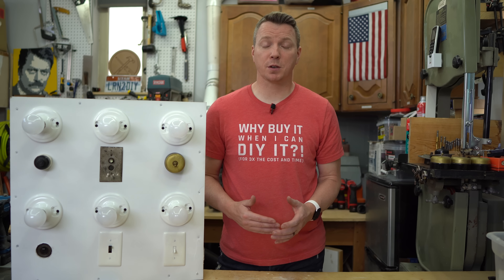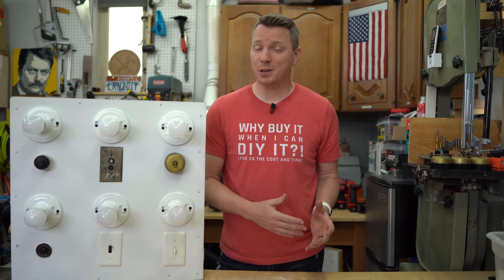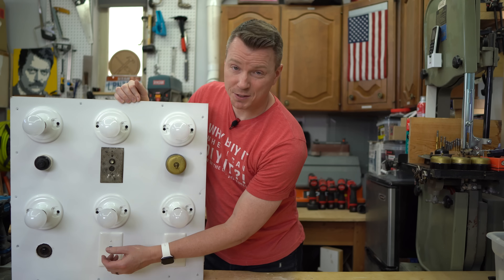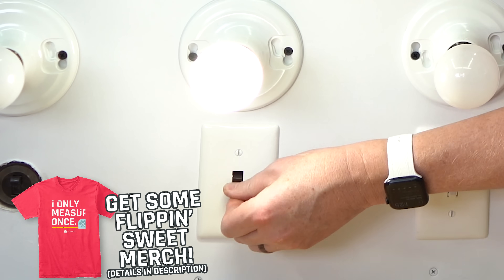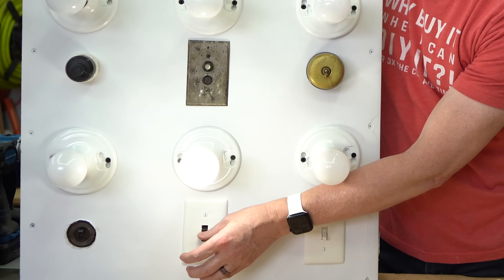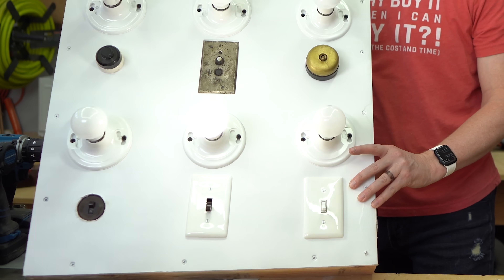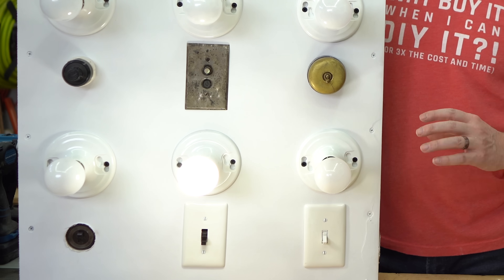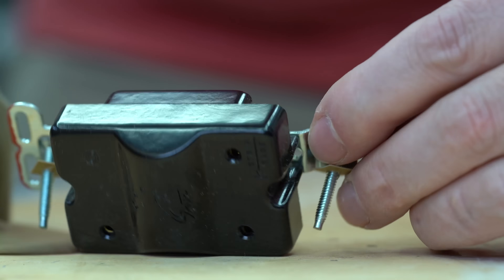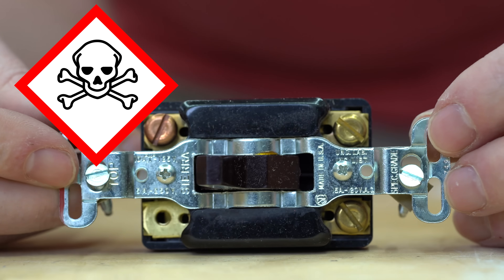As a result, we have here the first fully enclosed, completely silent light switch. Although this was patented in the thirties, it really didn't become popular as a light switch in the United States until the 1970s. That said, it had its downsides. Because there's liquid involved, if you try to move this switch on and off really quickly, the liquid is a little slower moving than our fingers tend to be. And because liquid involves gravity, tilting it at the wrong angle will turn it on or off using gravity alone — so you can't use this in mobile applications or upside down. But what ultimately killed off the mercury switch is the fact that mercury is toxic. The manufacture of the mercury switch was discontinued in 1991.